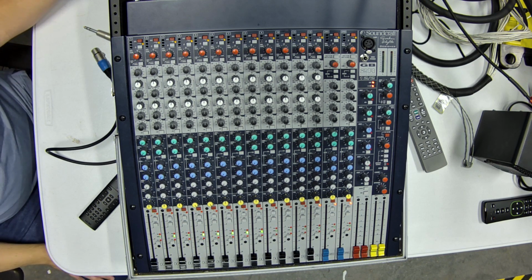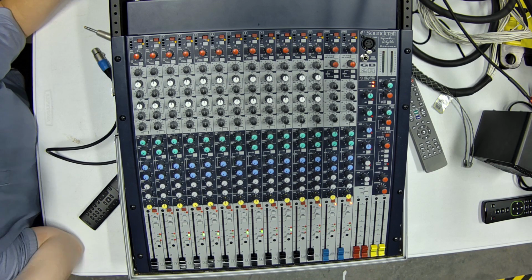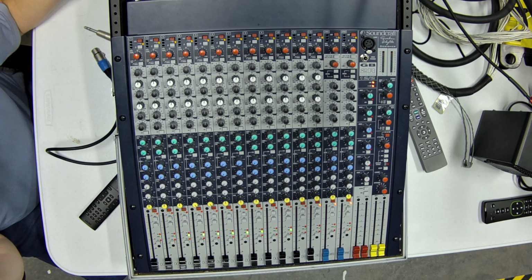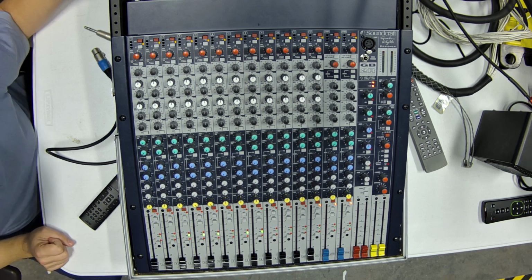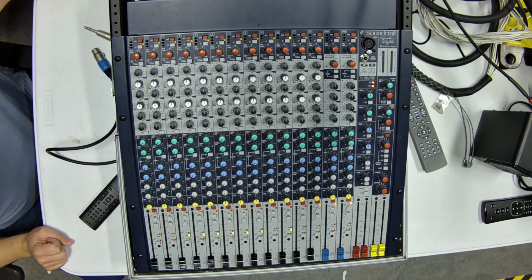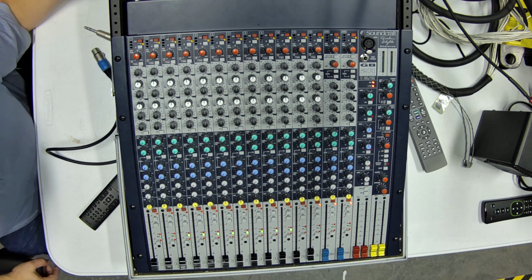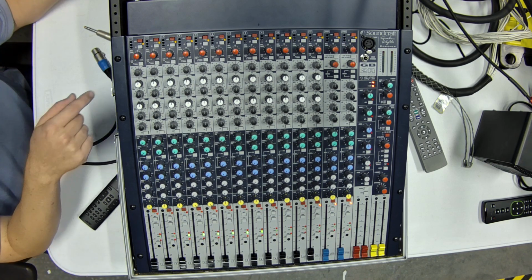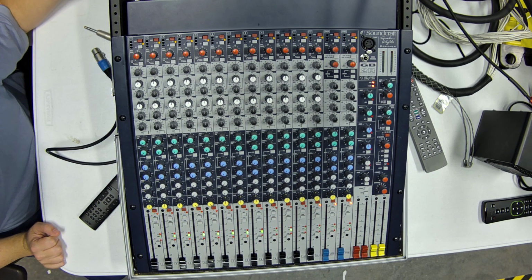So, say you've turned everything up. There's no distortion, but it's still really quiet. Could you up the voltage to get it to be louder? Yes, and that's the whole point. What's happening here is the line level signal is 10 times the voltage of the microphone level signal. It's a lot higher voltage, so it's louder. And therefore, it's going into the preamplifier at too high of a voltage, 10 times the voltage. And the preamplifier's like, I can't handle that. I'm clipping, right? And so what we do is we build in a little circuit in here that divides that voltage by 10. Is that just like a little resistor in there?